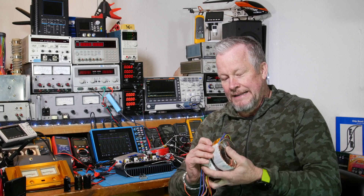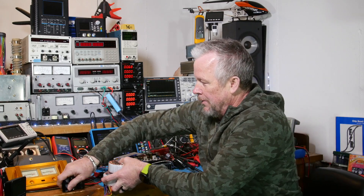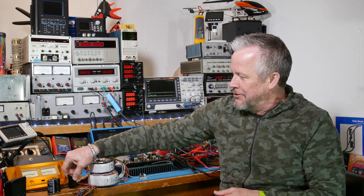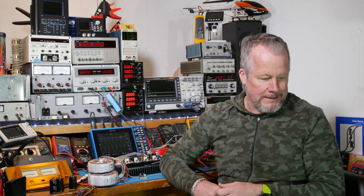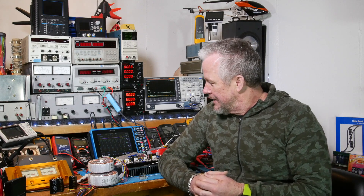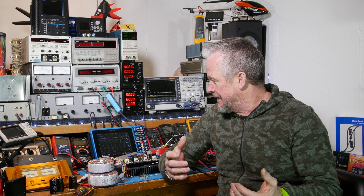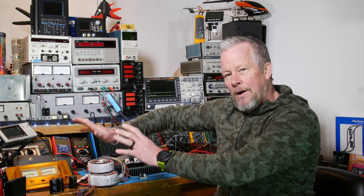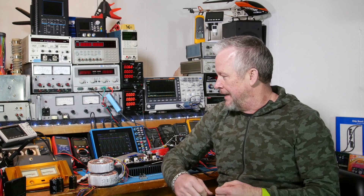Either one of these might work. We've also got capacitors to choose from — some 10 millifarad, 6.8 millifarad, and other values. We can do some math to decide, and using a lab power supply is a great way to test an amplifier in the beginning because you take away all the power supply effects and can isolate with a known DC voltage.